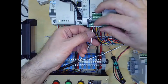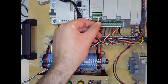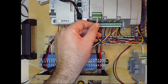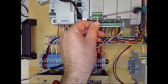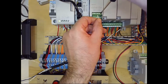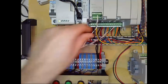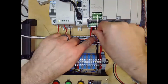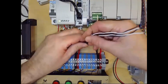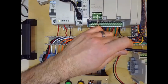And in twisted pair cabling, you typically want to keep them twisted as much as possible right up until the point at which they land. So I will try to thread into both 4 and 6. Okay, and I will thread those through there, and now this jacket is making it difficult to lay out nicely, so I'm actually going to strip a little bit more off of this.